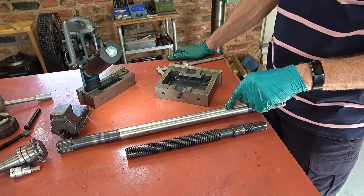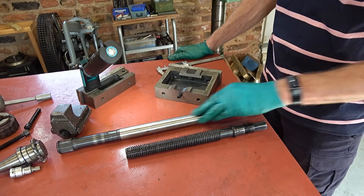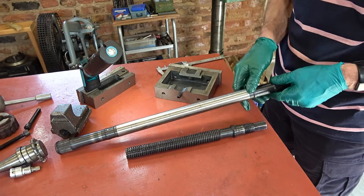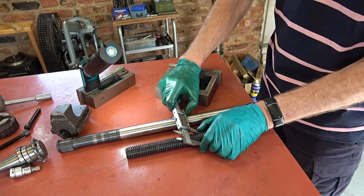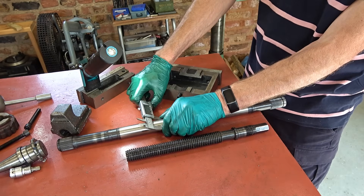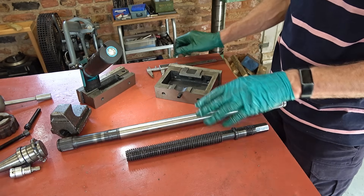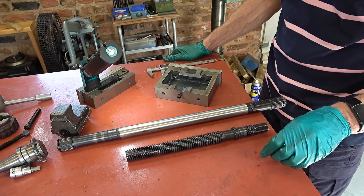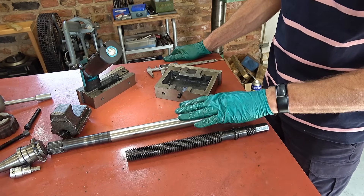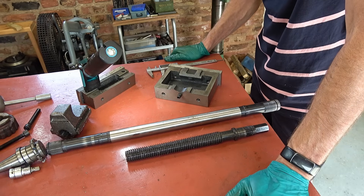So this is what I'm going to make the new screw from — it's a Volkswagen Passat half shaft. It's really nice material. I was doing some parallel turning tests, that's why that's nice and bright. Now this is 27mm and this is 27.65, so it's absolutely perfect for this, as long as it's not too tough. I don't think it's going to be too tough. End of prep — I'll come back when I'm properly dressed and ready to make a start.